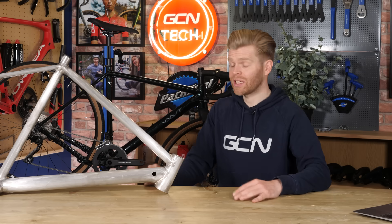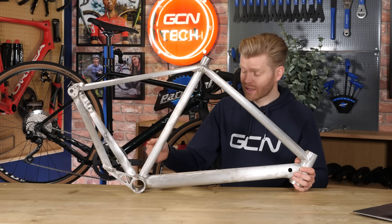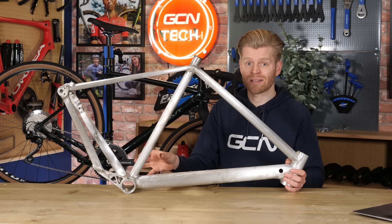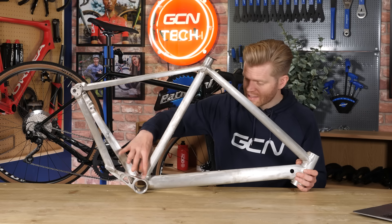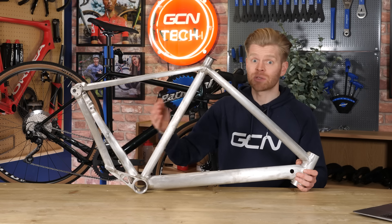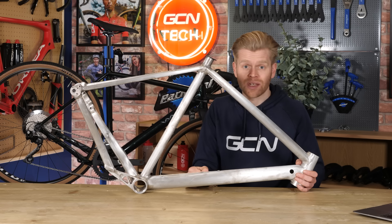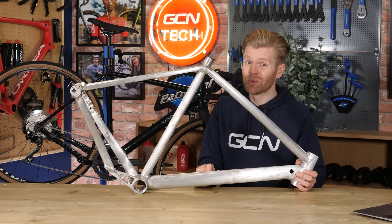Next, it's much easier to precision engineer. With alloy frames, it's much better suited to machining and precision engineering, especially areas such as the bottom bracket. It will depend on the exact type of bottom bracket standard employed in a given frame, but the advantage of having a single piece of alloy which you can accurately machine on both sides means you can much more easily achieve perfect alignment of your bottom bracket on both sides of the frame, resulting in a perfectly smooth spinning chainset. This can be achieved on carbon frames, but it's much harder to do so and much more costly.